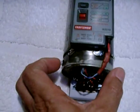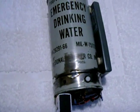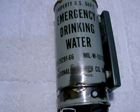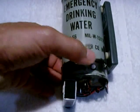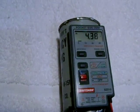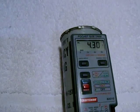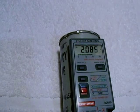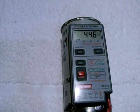There's also a hole here for calibration — there's a potentiometer in there. The meter doesn't have to be exactly on zero; you could start at 50 or 100. Once the meter stabilizes, if it stabilizes at 100 you can go from there — if you put something radioactive in front of the ionization chamber the voltage should rise. The unit is on, you'll see it goes to about 4.38 and then starts to drop to a level where it will stabilize. This could take about a minute or two. We're basically stabilizing in the area of 30 to 45.